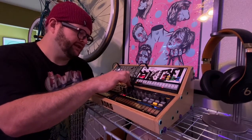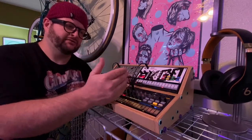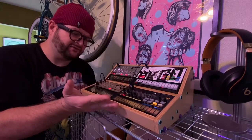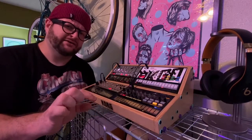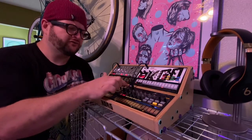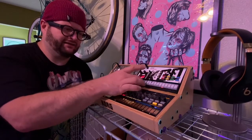I had to put it in through the middle. In a perfect world, I would have power come out on both sides, but because the power port is in the upper left-hand side, the middle units all come out right here. The best solution I could figure out was to drill a hole through this really thin beam in the middle. Plywood tends to chip and flake because of how it's constructed, so a hole like that is difficult to drill and not the cleanest. So I designed a little 3D printed part that goes over it with a big flange to kind of disguise the hole, add a little bit of color, and allow my wires to come through.